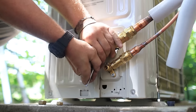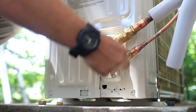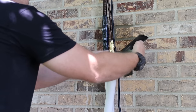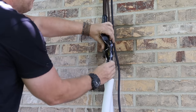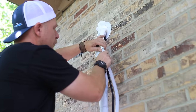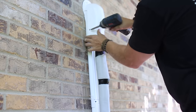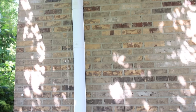After making sure everything was nice and tight, I used the Allen wrench and released the refrigerant, which pretty much means your unit is charged. To make sure I didn't have any leaks, I used some soapy water and looked for bubbles. After confirming no leaks, I wrapped the connections with sound-dampening pads and put on the insulation they provided. I hooked up the drain hose and gave it a good tug. Then I connected the line guard to the wall using tap screws, making sure everything looked nice and tidy.